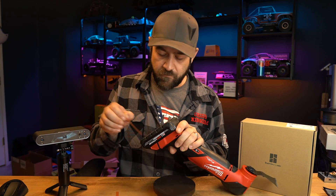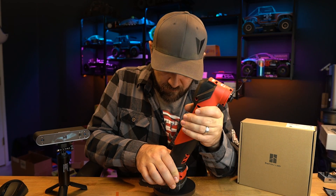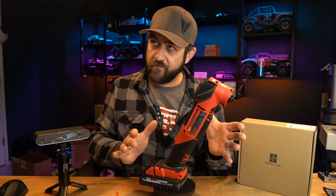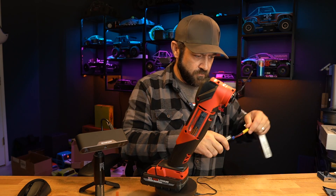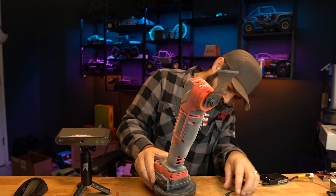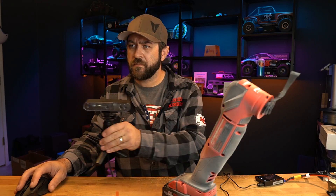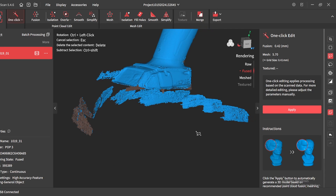We started off this project by taking the tool and double face taping it down to my turntable. This is the turntable that comes with the Revopoint Pop 3. I've got it as centered as possible with this kind of funky angle and powered it off of my servo tester for USB power. Here you can see I sprayed the tool with some dry shampoo to act as a developer spray, just let it spin a handful of times, trying to get as much of the important part of the tool as I could.